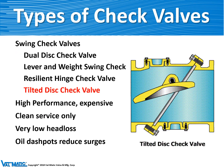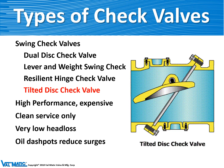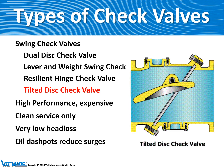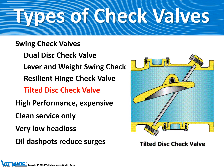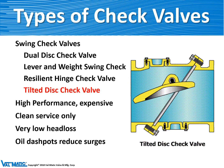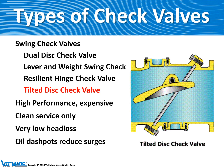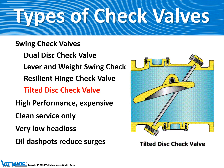The fourth type of swing check valve is the tilted disc check valve, named because the disc in the closed position is tilted. This allows the valve to pivot about its pivot pin and only needs to open about 40 degrees to get full flow — it looks somewhat like a butterfly valve but works like a check valve. Because it has a hinge pin that goes across the flow area, it can only be used in clean water, not in wastewater.